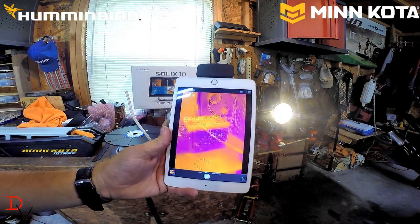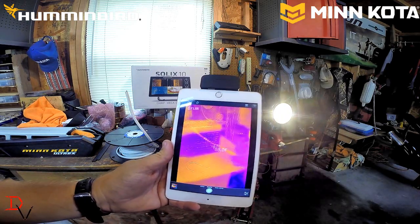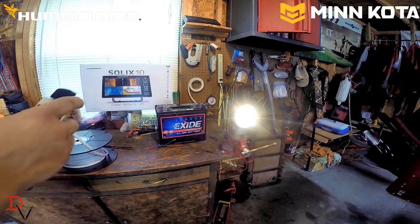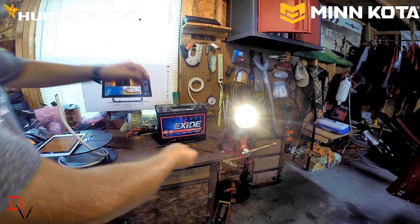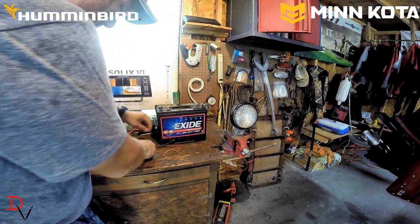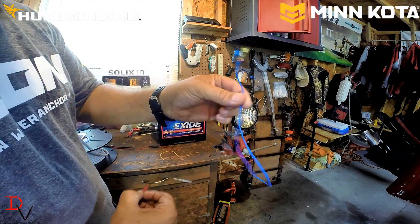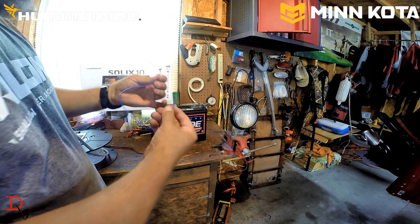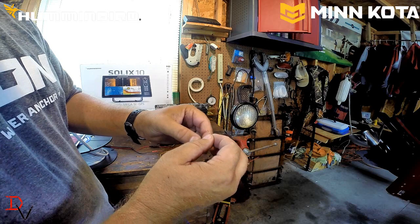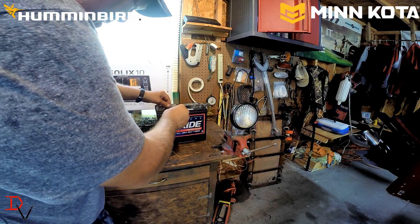What we're going to show you is I'm going to take that wire off. We're looking at about 80 to 85 degrees of temperature on that wire. What we're going to do is disconnect that wire. That wire was a larger gauge wire. We're going to go to this little smaller gauge wire. We're going to act like we got a butt connector or too small a wire. We're just going to crimp a couple of them wires right there underneath my battery terminal.